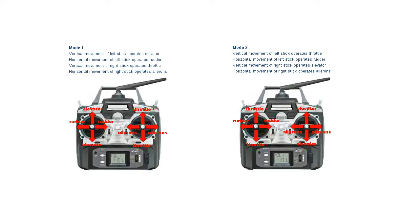I just thought I'd mention that it's pretty easy to switch this from Mode 2, which is what I made it for to start with, to Mode 1. You can do that by using a switch on the transmitter to switch between modes. Make sure the quad is not armed when you switch modes, because you're likely going to be switching from zero throttle to full throttle.